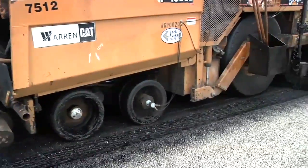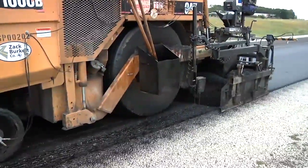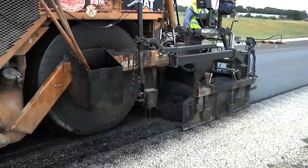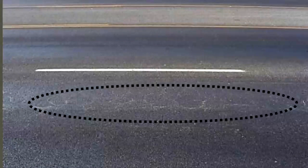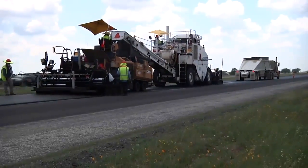The last mix is what's called a Tom F. It's Tom Fine. This is the one that we think has great potential. It can be put down, and it has been put down at a 1/2 inch thickness. When they're rehabilitating some of the interstate roads, the trucks are usually traveling in one lane, which is the slow lane. So they get beaten up. Well, the fast lane is usually in good shape. So normally they come and mill 2 inches off both and then put 2 inches overlay.